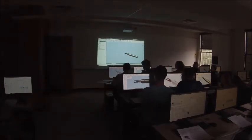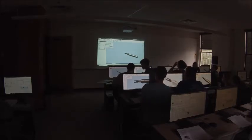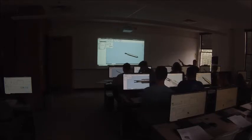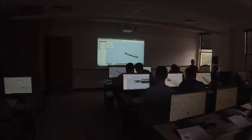Alright. Okay, anyway, if I go back and edit that constraint, we can put in an offset and move that clevis around. But in reality, that clevis moves in and out as the cylinder extends and retracts. If you remember what I was talking about last week, the air cylinder is modeled as a solid piece, right? It's modeled as a part, it's not an assembly. So the rod of the air cylinder isn't going to be able to move in and out in our model.